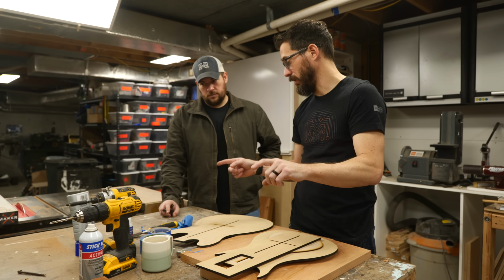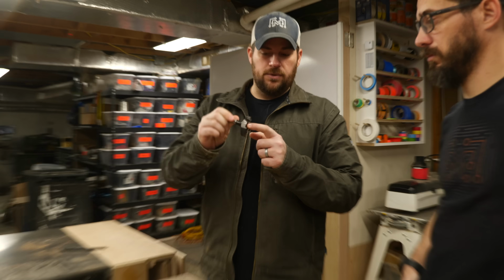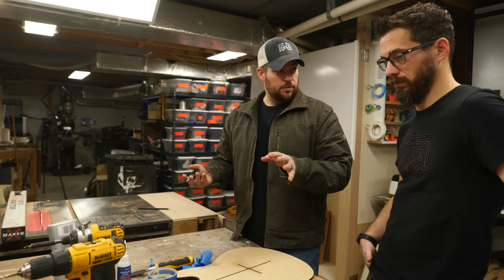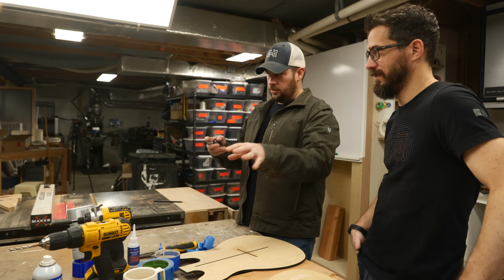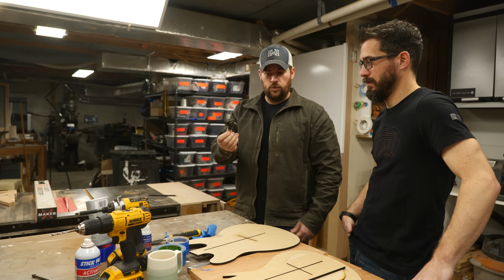Yeah. And you had an idea for that. I do, because I'm using the CNC, we have a massive 3-inch surfacing bit. Now, rather than putting those through the jointer and the planer, neither of them can take that size of chunk of wood. I can put yours, and I can take the two of mine on the CNC, and I can thickness plane them with this massive bit.